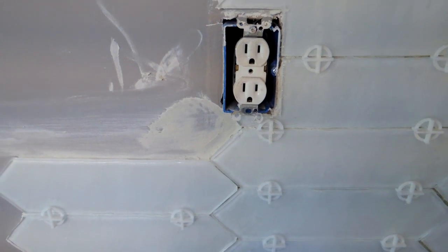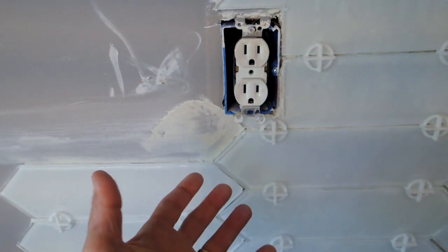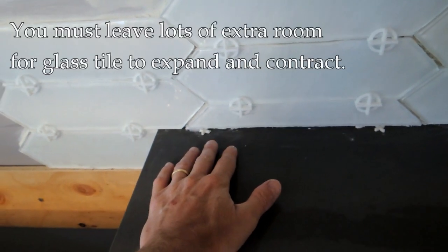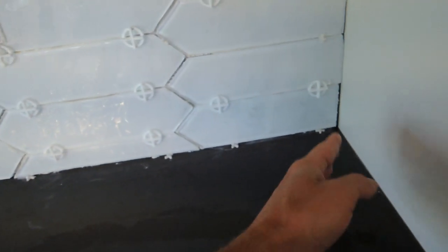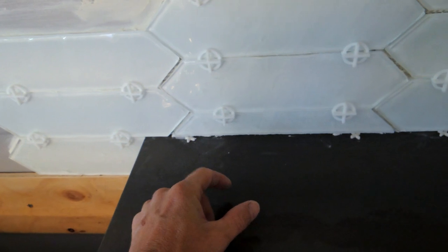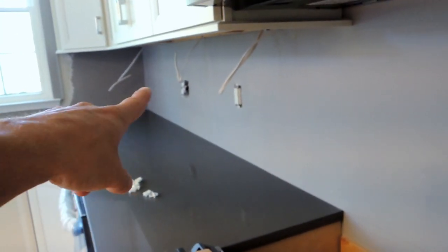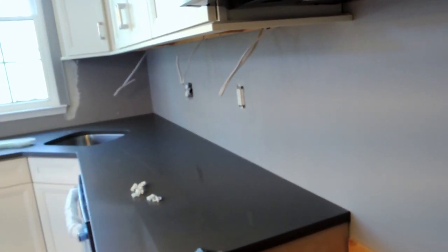Porcelain is easier to cut around things like this. You're probably going to need a large cover plate for each box, and if you can adjust the pattern to get around the box, you should do that. Glass tile expands and contracts with temperature, so you need to leave quite a bit of gap on the bottom, on the top, and on the sides. That will not get grouted — it'll get filled with a silicone caulk that can move with the tile. If you don't do that, you're going to get cracks in the tiles eventually. They'd like to have an expansion gap every eight feet.